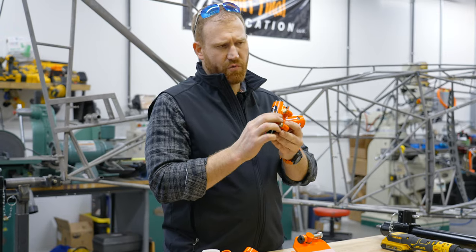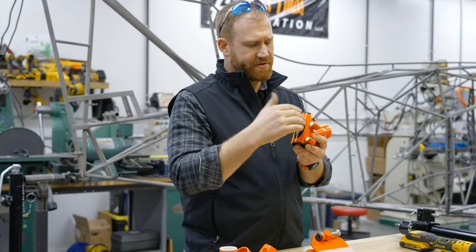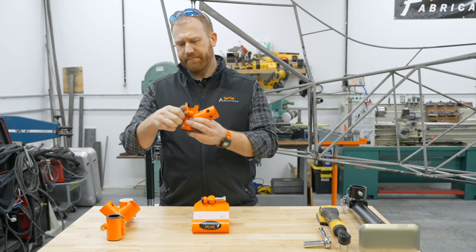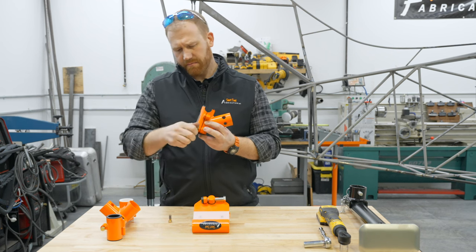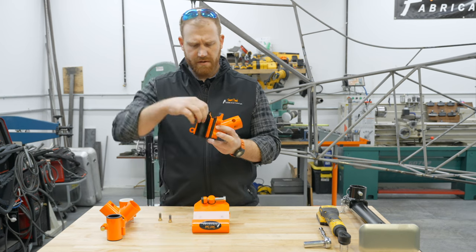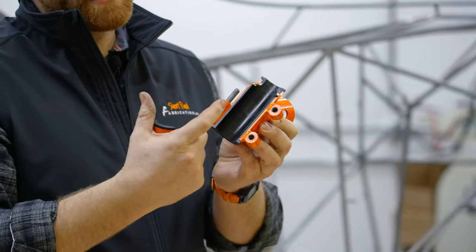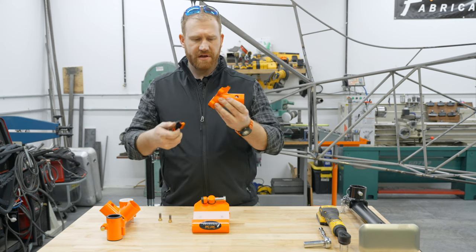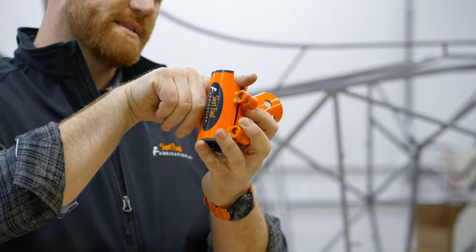This utilizes the rear gear tube. There's a 1-inch piece of chromoly tube that's welded as a brace for part of the structure. This has been machined away — it's been coped — and the bushing has as well. That basically opens it up. It's got just two 3/8ths bolts in it, a lot like the Cub jack. It has a much heavier-duty barrel-type bushing in the back just to account for the weight. This would go towards the inner portion of the aircraft, then you just put the clasp on, and the cope goes up so the tube slides right into it.